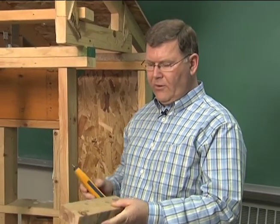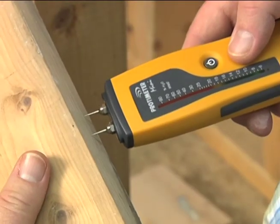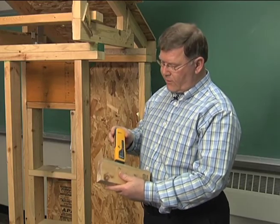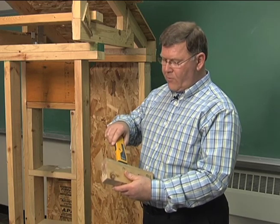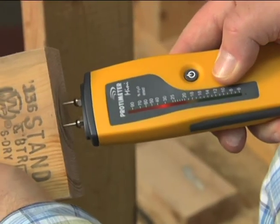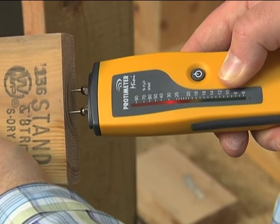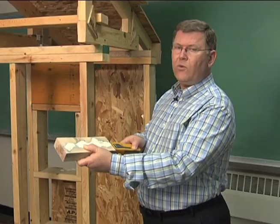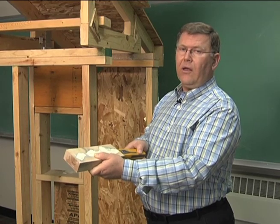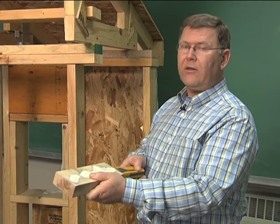I have here a piece of wood that has been soaking. What we do is just take and push that probe into the surface and measure what that moisture content is. If it has been in a very damp environment, we would expect that moisture meter to read in excess of 20% moisture, as shown on this scale. If we're at moisture contents over 20%, that is wet enough that we would see decay occurring in that wood, indicating that we need to leave that wall cavity open and continue drying.